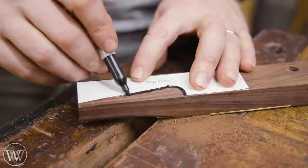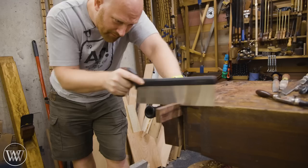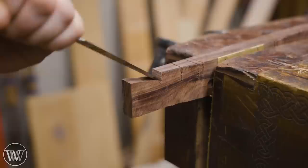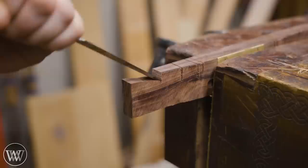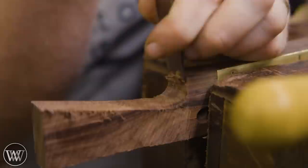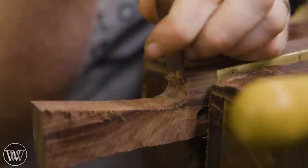A spokeshave is really good for compound areas and getting into odd spaces, but the rasp and file are better for tight areas. For a lot of this there's a small, tiny curve, so it's easier to come in and chisel out the majority of the waste. In some spaces you're only taking an eighth to a quarter inch off, but in this section you're coming down a half inch or more. I love this big rat tail file — I don't know where I found it, but it got me the radius I'm looking for.